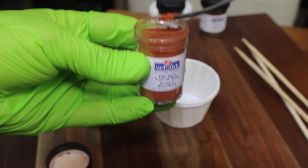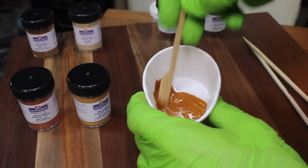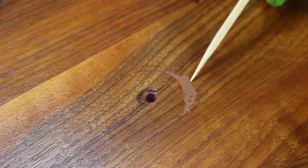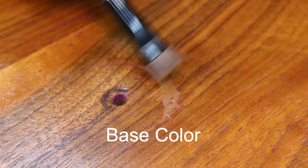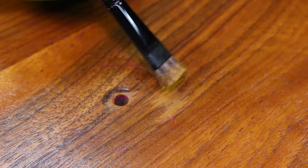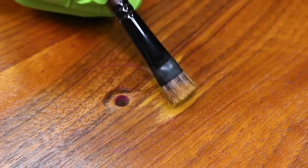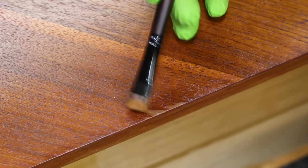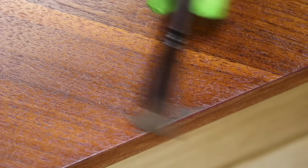The sealer dries quickly, and once the first few coats are on, I can begin what I think is the most difficult part, mixing powder stains to match the grain patterns and colors where the epoxy was applied. This is yet another skill that requires patience and practice. With each new color, I'll spray a light coat of sealer. Some areas turned out great, but I think I may have made other damaged areas look worse than if I had just left them alone.